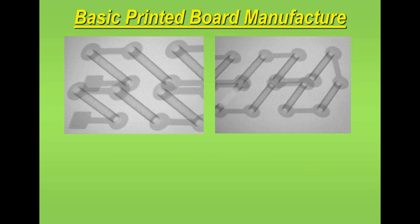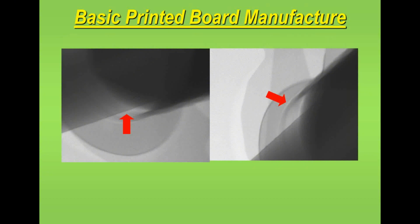And it's always nice if you have that facility in assembly, then use it for checking your PCBs. Another example where I've used X-ray to check PCBs is where we had open circuit connections on plated through holes, and I was able to detect where the copper had separated from part of the plating. And I've illustrated it here with red arrows. Now this is not easy to find. If you know you've got a failure, it's certainly easier to find it, and of course you can do this sort of investigation very inexpensively yourself before you cut the printed circuit board up. So just think about the tools you have and see how you can use them for different things.